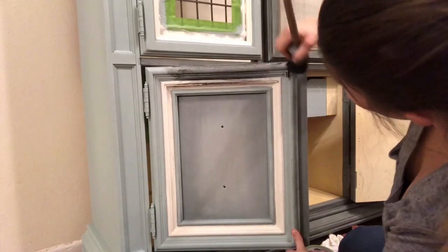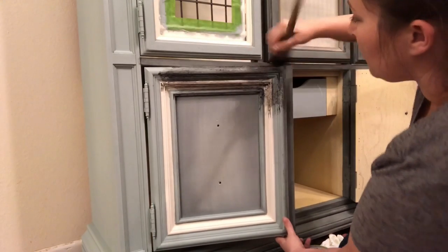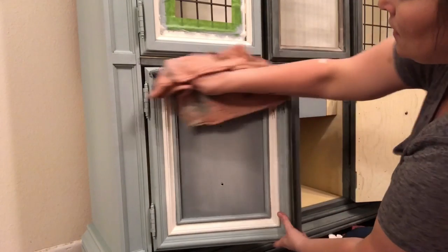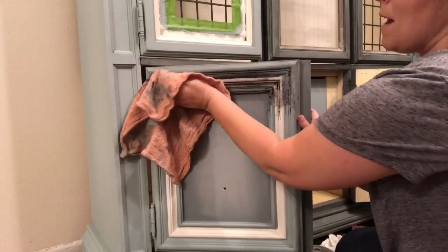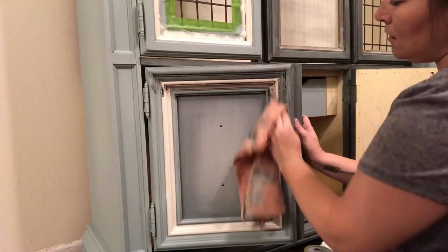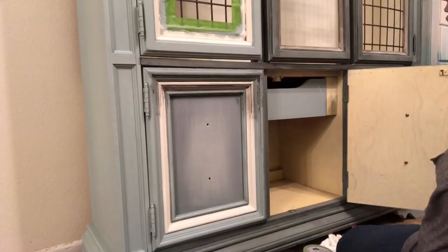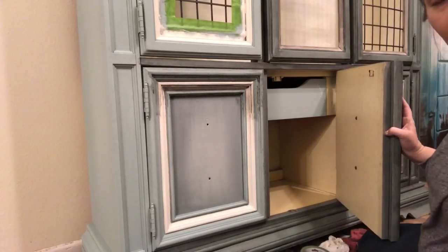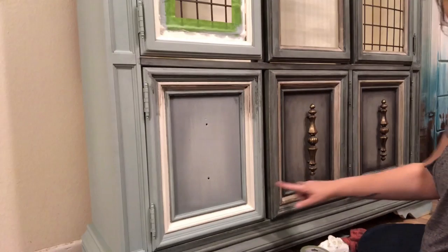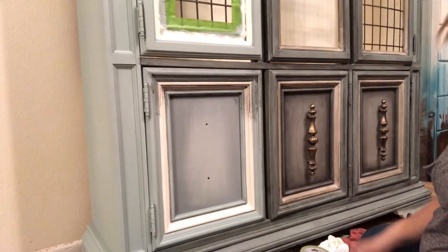This takes a little bit of arm work. I'm just going to add a bit of wax and I've worked it in pretty good, and now I'm wiping it back pretty much immediately. There's a lot of detail on this door and it's settling really nicely in those grooves. I want to show you the difference before I completely change this — you can see the difference between adding the black wax and not. See how much darker it gets with the black wax? It pretty much looks like two different pieces.